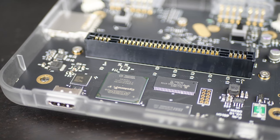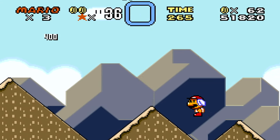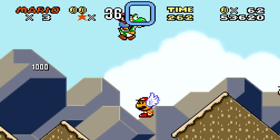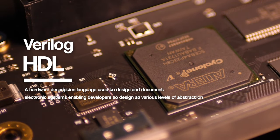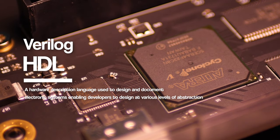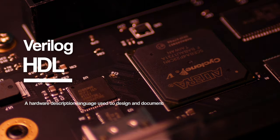It reads controller inputs the same way as the original hardware, generates its video entirely in real time, and is free of any additional overhead or lag, but it's ultimately still programmed much like an emulator. You see, the Super NT's core is written using a hardware description language known as Verilog. This language essentially allows the developers to define digital circuits in a textual manner.